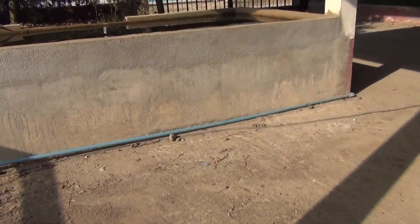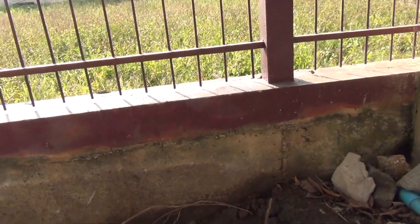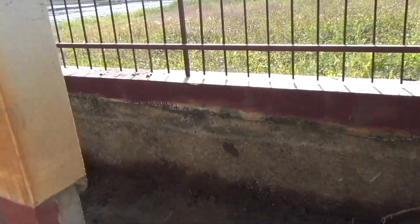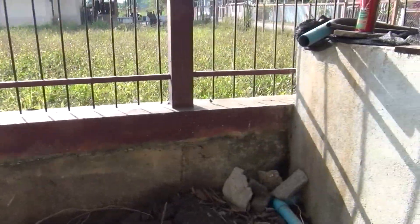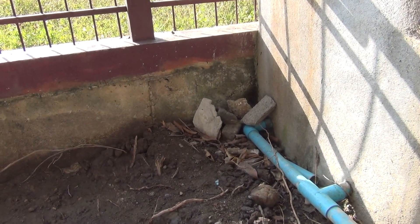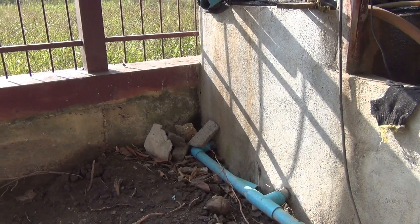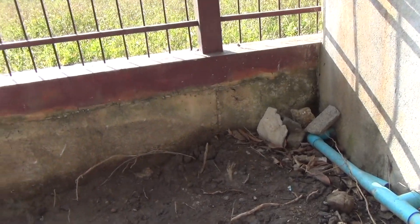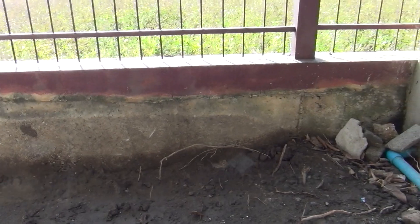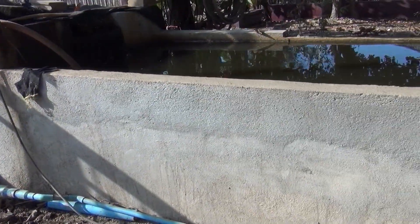The plan is to bring this floor all the way out. I've also been thinking that since sometimes when you get wind coming in this way you get water in here, what I'm gonna do is in this little corner here, dig down maybe a foot or so, fill it up with gravel, and put a little channel from that side over there all the way down, so the water will just go down into the ground.